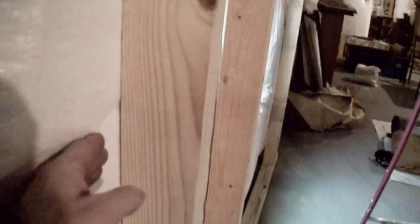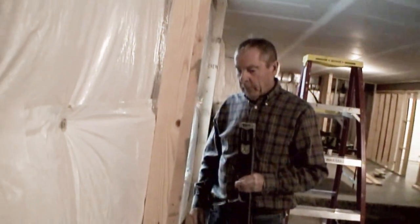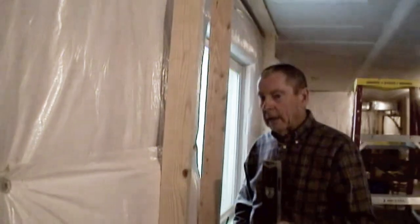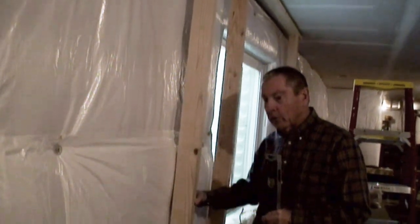So I'm over here right now and I got my hand up. You can see that the stud is right up against the current insulation without actually compressing it or pushing it. I guess that's what Tom's trying to figure out. Where does he want this thing to live? Because wherever it winds up living, the whole rest of them have to live in the same line. Exactly. And it's not uniform insulation going down there at all. Right. So what I would do is probably not get it real tight here. Maybe give it a half an inch or so to allow for ones that might stick out.